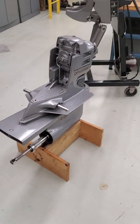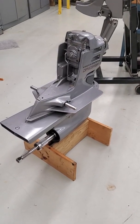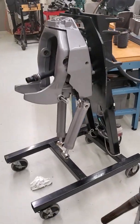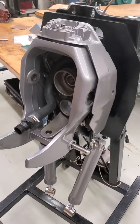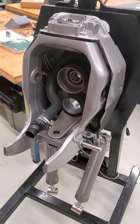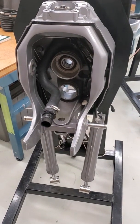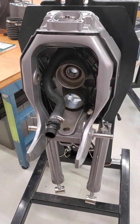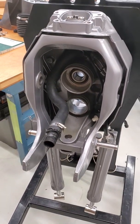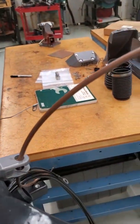Week one, we started talking about stern drive technology as well as lower unit technology and the differences. So this is a DPS drive. The first thing I have the students do is take the drives off stands so they learn how to remove them, and then we get directly into transom assembly repair, which is a pretty unique task for them to learn. They get into taking the bell housing off and the drive components.